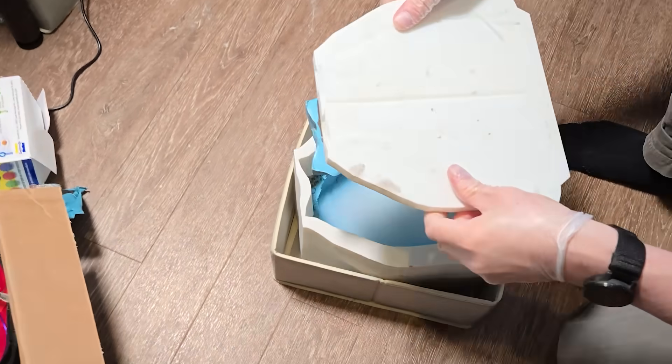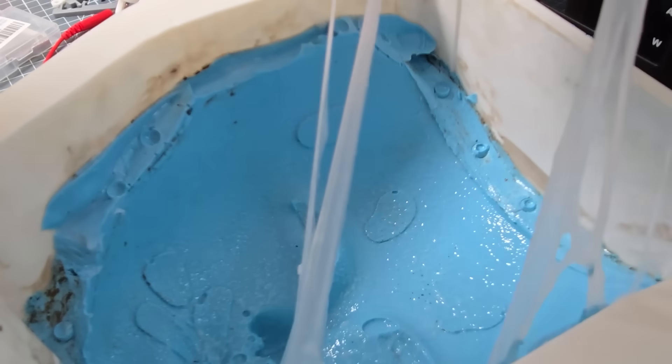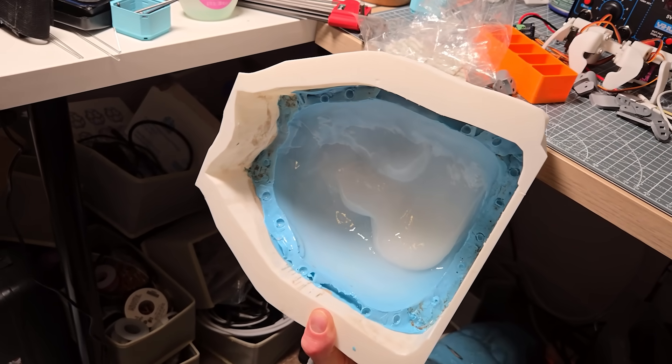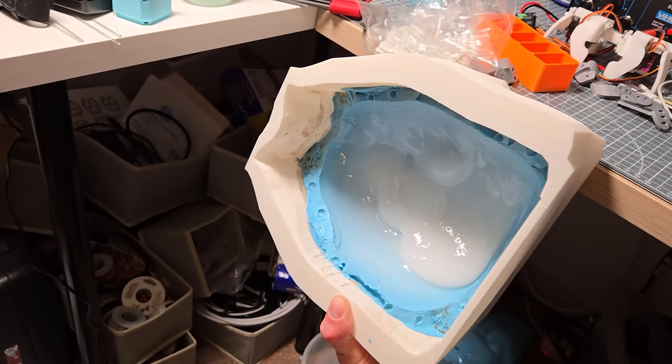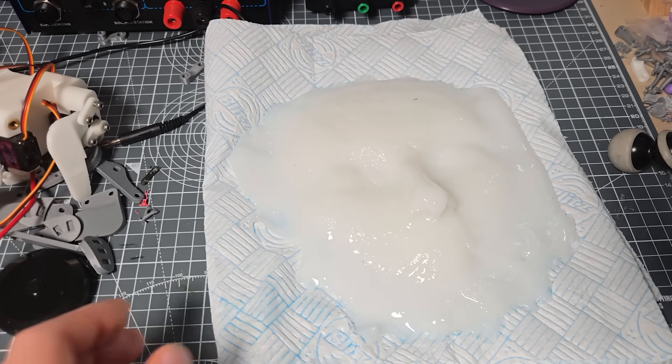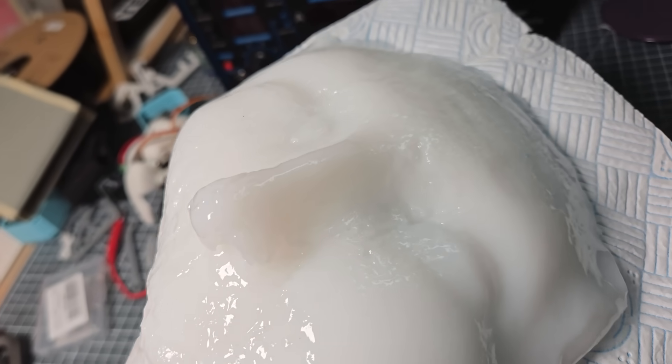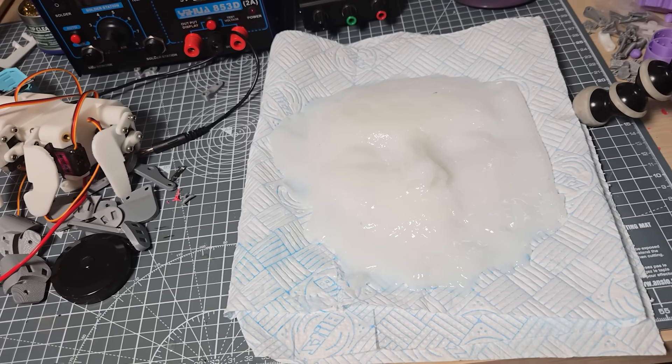The shape I made in clay would be the negative of the silicone I poured into the top, and once I pulled out the top mold, cleaned off all the clay, and recast the bottom half, I'd have what I originally modeled in clay now made out of silicone. I miscalculated how much silicone I needed, ending up with half-full molds which I had to fill in with clay each time. I used mold release spray to ensure I'd be able to get it out, but I must have used the wrong type because the silicone never cured. I washed everything out — a huge gross sticky mess — then tried again without mold release, with very accurate measurement, thorough mixing, and a slush casting technique to get an even layer, but once again it didn't cure.